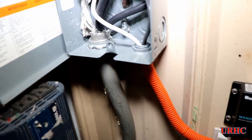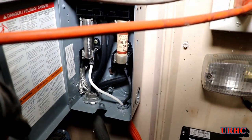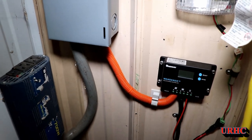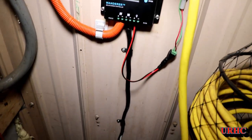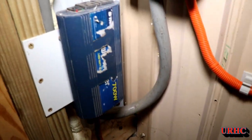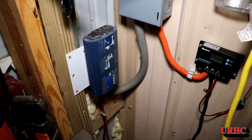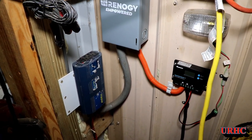You can see I've got some pretty heavy wires coming up through there, and they do go through a fuse to fuse the system. I put big wires so I can put more panels later. Then it's going to go through the charge controller and I'll be installing the batteries in a second. And then I just have a simple 700 watt modified sine wave inverter to make 110V, which actually powers all the lights in my barn.